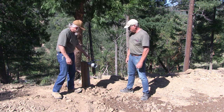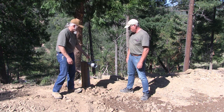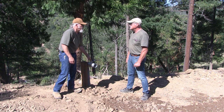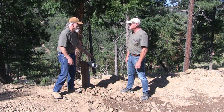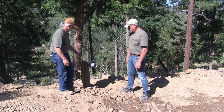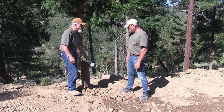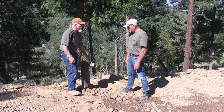I did my last property on 4-inch. There's no way you could do that these days. It's just way, way expensive. Even the 3-inch was difficult, but you have to have at least 3-inch for any fire department or any fire apparatus that would come. They won't pull off anything that's less than 3-inch. So if you had a 2 or 2.5-inch, they won't even bother with it. Good to know. So you need the volume that the 3-inch gives. So 3-inch minimum, 4-inch is obviously better. Yeah, obviously more volume, more pressure, but this is the best we can do on our budget.